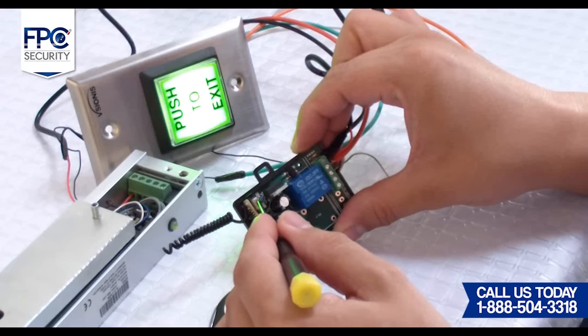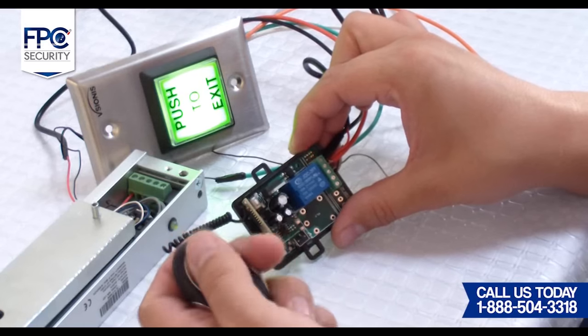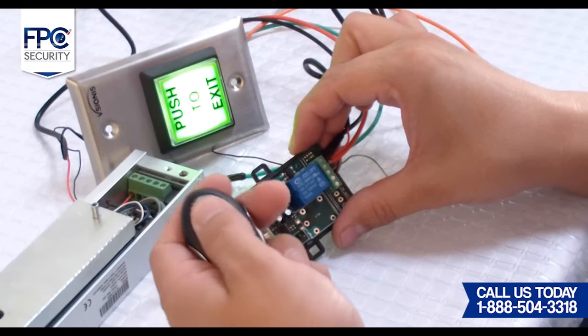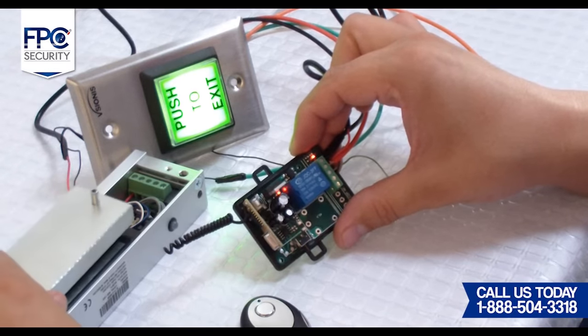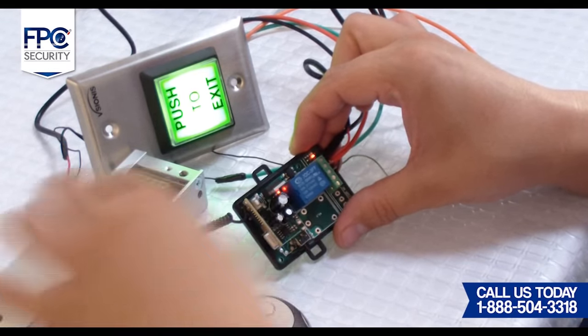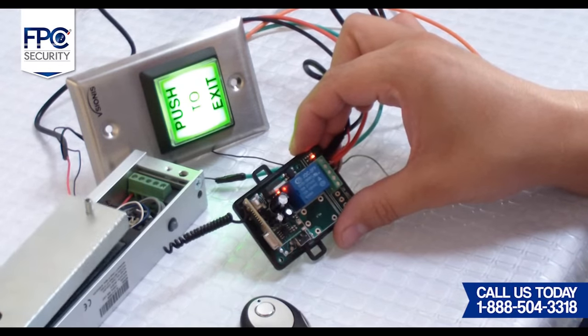automatically lock. The second function that would need to be programmed works very similar to a light switch, on and off function. In order to program this, please get a small flat end screwdriver and press the function switch. Hold that button for about 3 seconds and then press it one more time until it flashes twice. Once this has been done, you have programmed the second function.